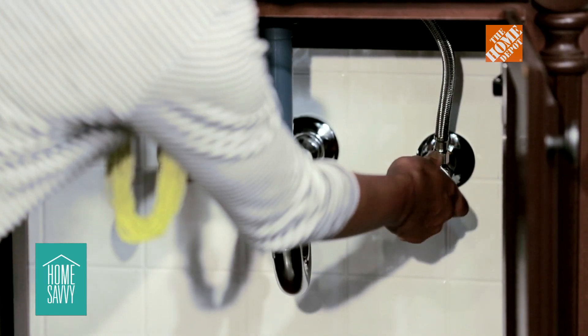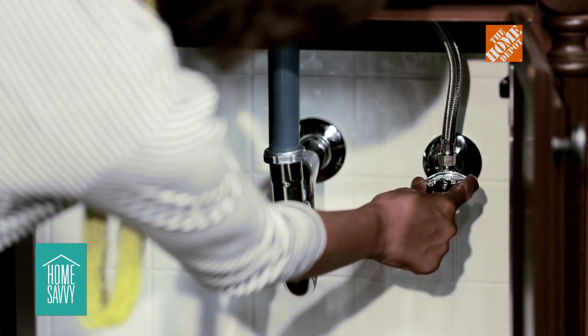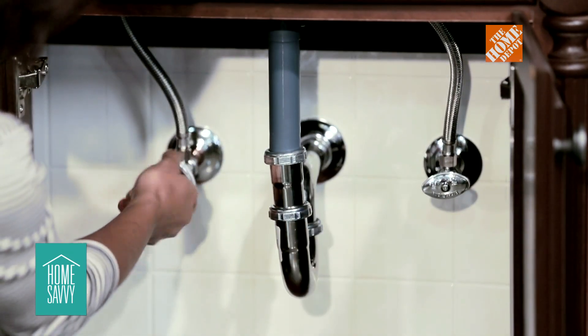What's the next step? Today we're doing this in the store, but if you're doing this at home, there's some pre-preparation needed. First, make sure that you shut off the water supply at the sink or your home's main supply. Then disconnect the supply line and the waste trap from the sink. You also want to disassemble the sink and the pre-existing vanity. You want to paint, patch, or replace wall tiles where the sink and old vanity used to be.